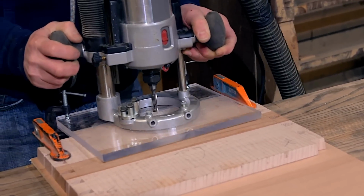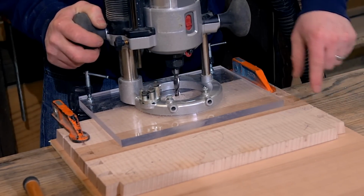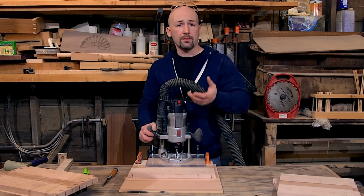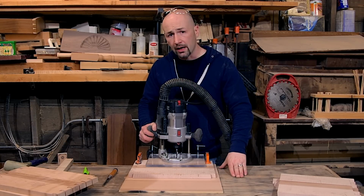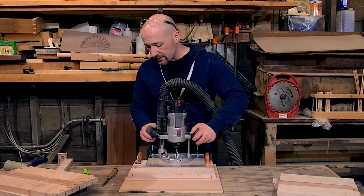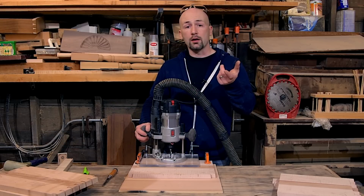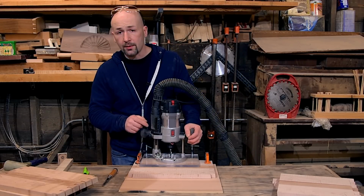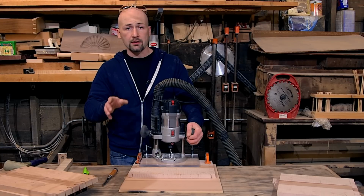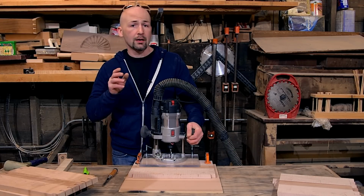You can see I've taken a moment to clamp my work down, and I've put a sacrificial piece underneath so that as the bit passes through, it'll keep it from chipping out and also keep me from leaving a mark in my bench here. And I needed to clamp it down anyway, so I'm using these clamps as stops along the length so that I won't accidentally make too long a cut. I've set the depth on my router. You can click a description and link below to see the quick tip I did on how to set your router depth. But with all these things in place, let's see how nicely the router makes this cut.